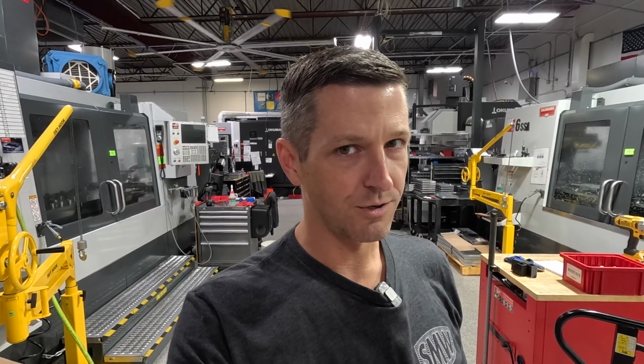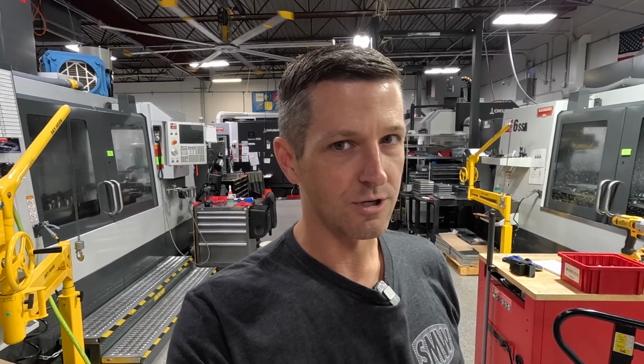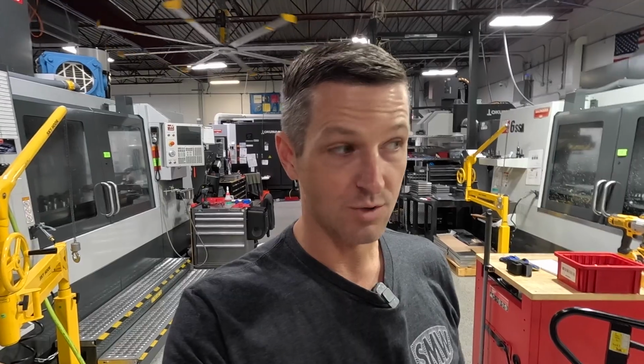Which was one of these whoa moments where you're like, wait a minute here. The material costs you 52 cents and you just bid the job for less than the material cost, while you're using probably a $1 million machine to make 1 million of these parts. And the answer was, anybody know the answer? The residual value of the scrap. Now, brass happens to have a really high scrap value, and they were removing a lot of the material.